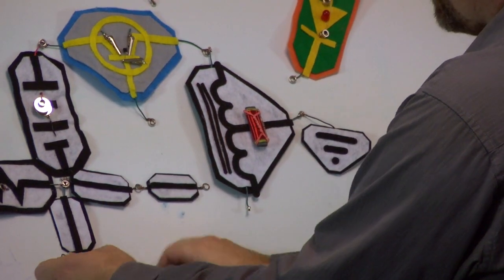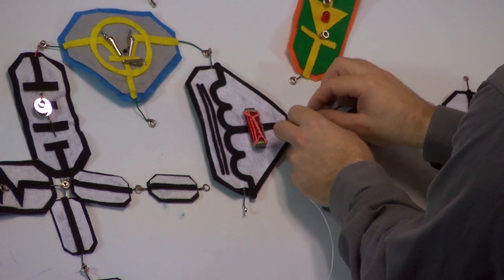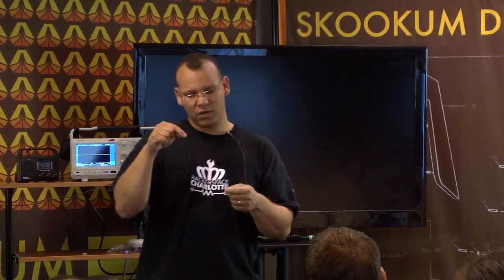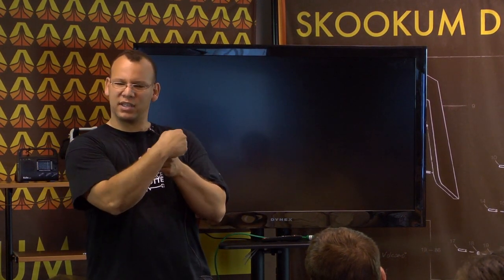Now here's an interesting thing to know. We say ground. Have you guys ever messed with a grounded electrical cord? It's got that third prong on it. That third one goes straight to ground. And there's a saying that ground is ground the world around. So to make a basic circuit, you have to have a loop. You have to go from the positive battery terminal to the negative battery terminal. You have to complete that loop. But the crazy thing about ground is if I stick one side of my light bulb onto one terminal of the battery, it's not going to turn on until I stick the other side to the other terminal of the battery, right? Does that make sense? Is everybody familiar with that?